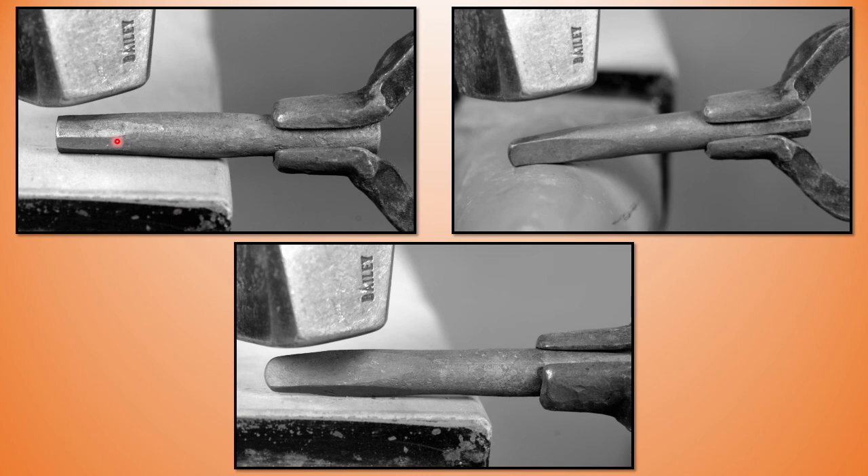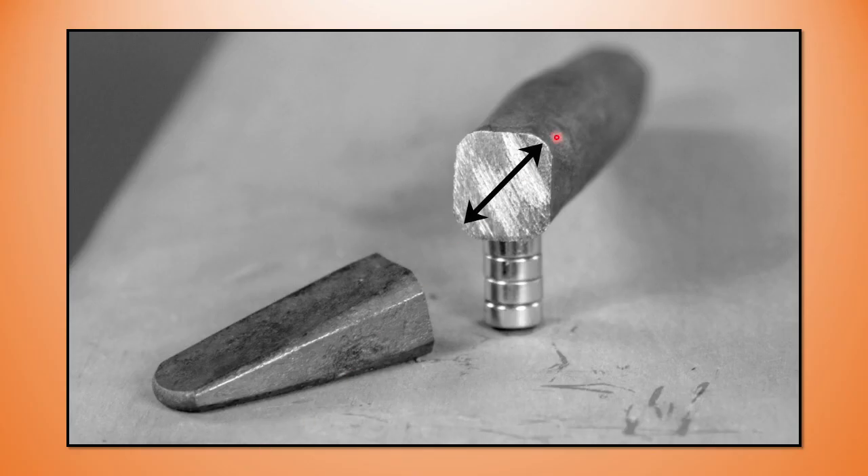I make a quick octagon, using that opportunity to try and straighten out any bend in the bar. Don't try to whack it or you'll put a ding in your nice round drift. Once the struck end is done, turn it around — you can reach around the struck end and grab the round portion of the stock — and draw out the working end over the bick. The working end of a drift must reflect the size and shape of the hole you intend to resize and reshape; in this case I'm going for something like a half-inch hole so I don't need a great degree of taper on the end. Relieve the corners heavily — the diagonal measurement across the corners, even on a tapered section, can be in excess of the main body of the drift, so spend time removing those corners.